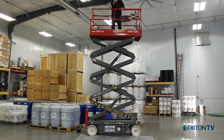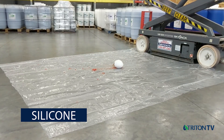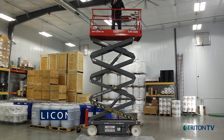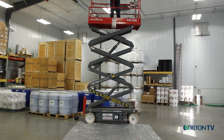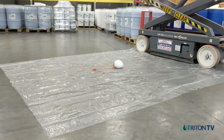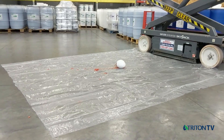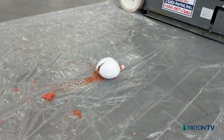Third is a very popular silicone roof coating applied to the melon at 50 mils. While silicone has higher tensile strength than acrylic, the impact test shows how easily silicone tears once a split begins. With both silicone and acrylic, even 100 to 300% elongation does not allow for much movement when fully adhered.